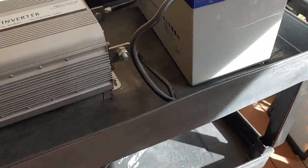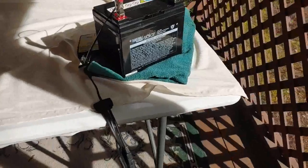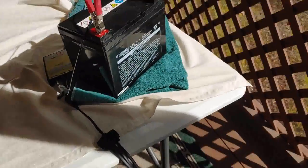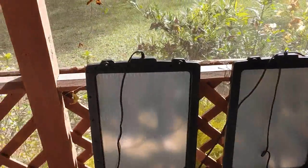I also use the cart to bring batteries out when I charge them. Let me walk over here and show you what I mean. This is a small AGM battery, another Thunderbolt — 12 volts and only 35 amp hours. I have it charging right now. Here's a little charge regulator; you can see the light on it that it's operating and connected. It's simply connected to three 15 watt solar panels I got from Harbor Freight. There you can see them. Yes, I know it's not going to get much sun there, but I brought it up on the porch just so you could see it — they're normally out there in the sun charging up.